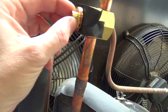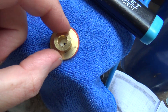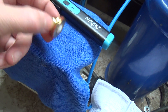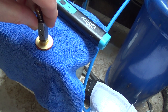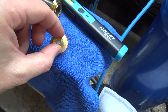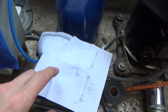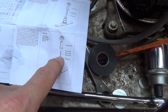And that seems to make a bit of a difference as to where that little button sits. Because when that's in there it's sat about there, and that little pin needs to cover that pilot hole in the centre. The gas pressure comes up through that bleed hole - more surface area on top than underneath, so the gas pressure actually pushes the valve shut. But it relies on that pin covering up that hole. So I think we might put it back together with the spring that way round, see if it makes a difference. I might read the instructions to see if it says anything about which way round the spring has to go.